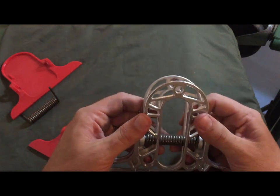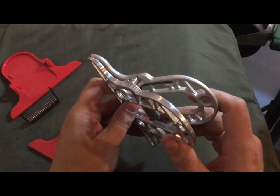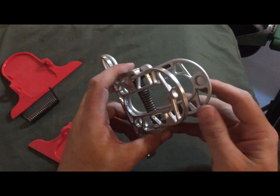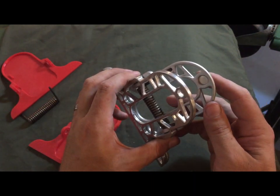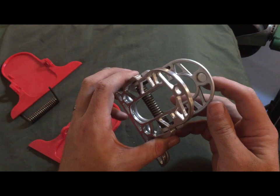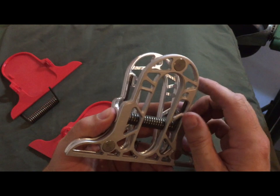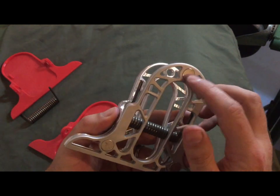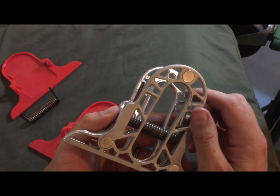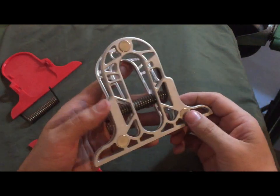I figured, to be on the safe side, that I would leave it a pretty close fit, and then if I needed to, I'd glue it. So there's probably about a half a thou interference there. So the aluminum does put a little bit of a squeeze on the magnet, but I think it fits really well, and we haven't had these come out or anything.